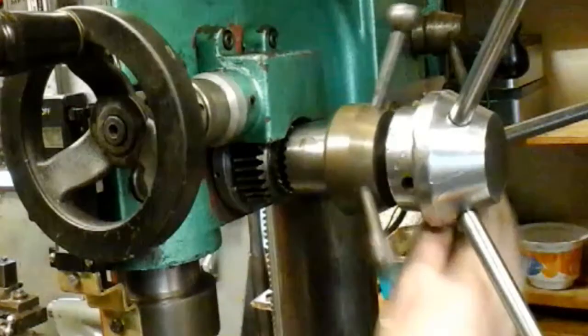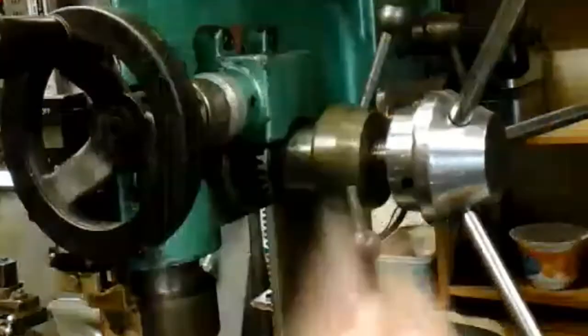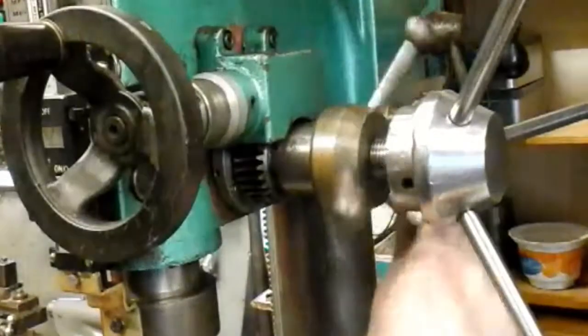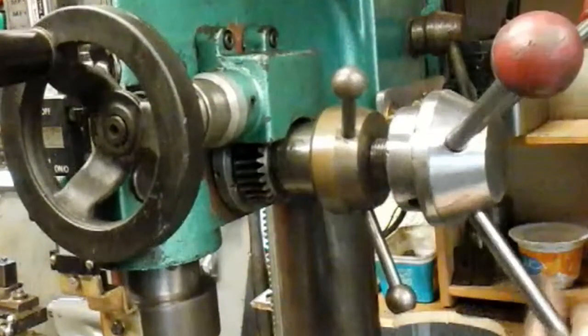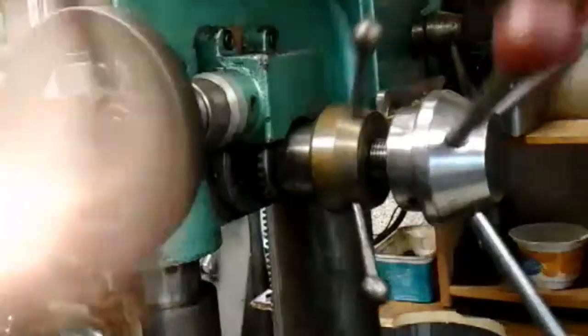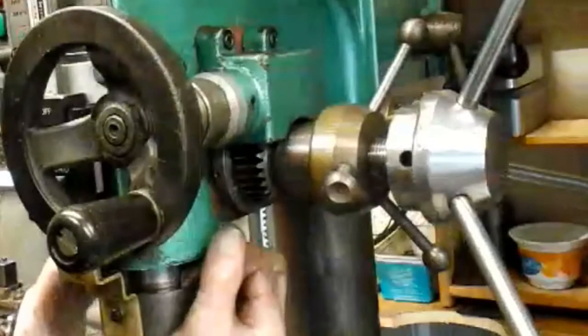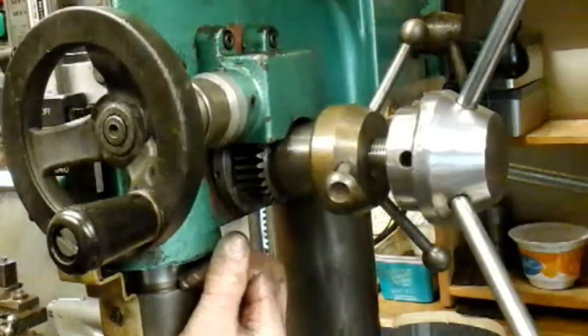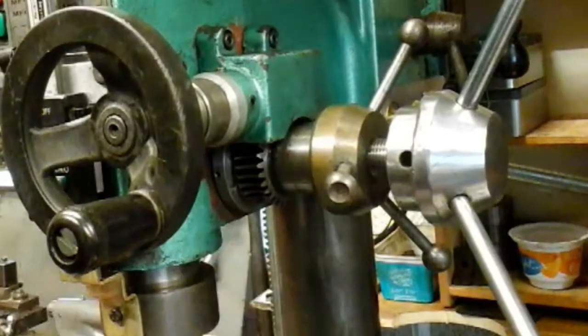Like I did, I set it with all the mechanism off, just using my drilling handle. It seems to be working fine - not too stiff at all. And I can perhaps just get one thou of play on it - maybe only half a thou.